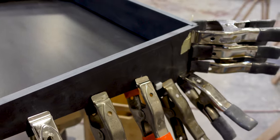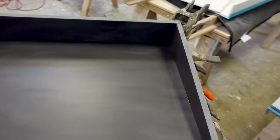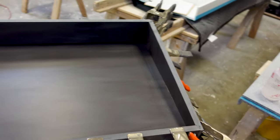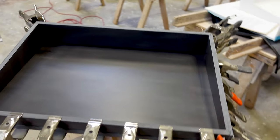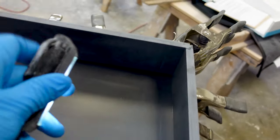It's all glued up now. The hardest part is cleaning this inside corner here, because you need glue to come out of there. But if you get too much glue, it gets on the surface of the sink, and then you can't clean it off, and you're left sanding the whole sink again, but it's almost impossible to sand those inside corners.